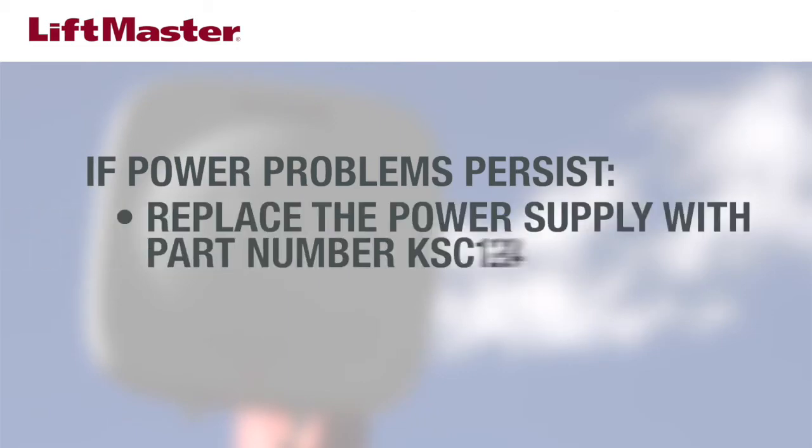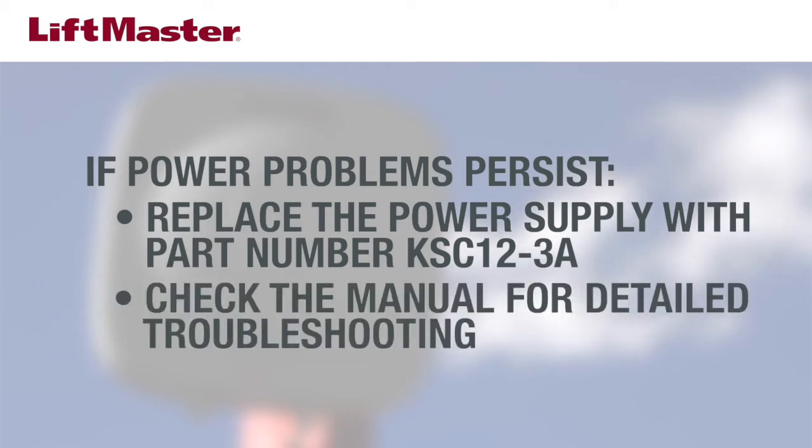If you've corrected all issues with power and there are still problems with performance, replace the power supply. You must use power supply part number KSC12-3A. If replacing the power supply doesn't resolve the problem, check to see that the main power source hasn't caused an issue with the reader. See the RFID reader manual for detailed instructions.